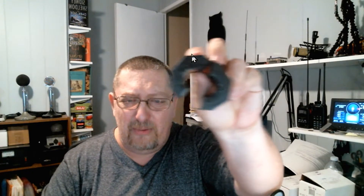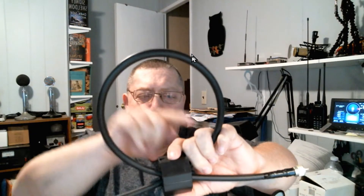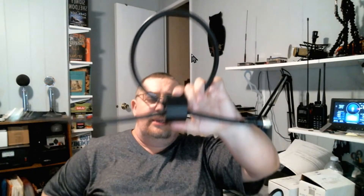If you want to spring through these much larger beads, they are a really good size. You can also use the cumulative effect and go around two or more times, then snap the bead shut. This one bead is now counting as two. You count every time your wire goes through the center as one pass — go through again, that counts as two. Each time you go through it has a cumulative effect giving you more of an impedance choke.